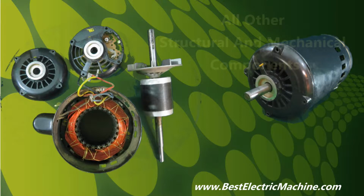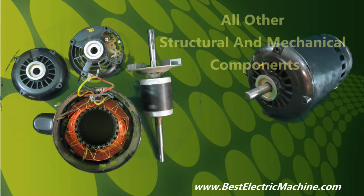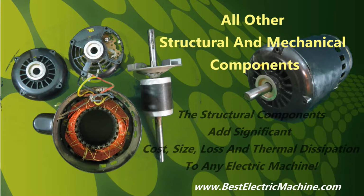Fourth component, all other structural and mechanical components that do not actively contribute to the electromechanical power conversion process, but instead, provide air gap dimensional integrity under enormous magnetic and dynamic forces, such as the bearings, housings, end plates, etc., provide thermal management, such as passive or active cooling, provide reduction of hysteresis and eddy losses, such as special electromagnetic and laminated materials, and provide high winding conductivity and voltage isolation, such as special insulated magnet wire and winding arrangements. Note, ironically, the structural and mechanical components add similar but significant size, cost, energy loss, thermal management, or design effort to any electric machine as does the electromagnetic design effort.